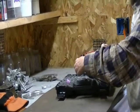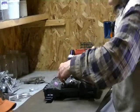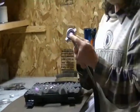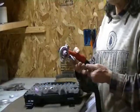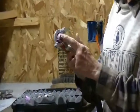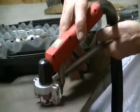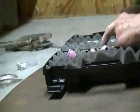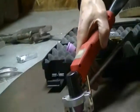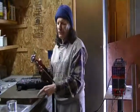What I like to do, even better than that, is I just leave the standoff spring that comes with the plasma torch. This is your standoff spring, which keeps your tip from touching the metal, and that glides along just fine on small arcs. So I just leave the spring on and leave the wheels off for these very sharp corners.